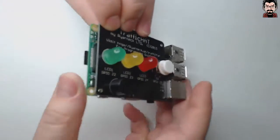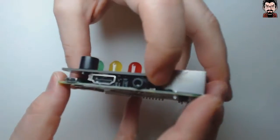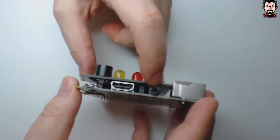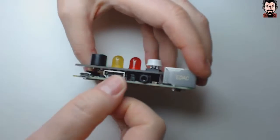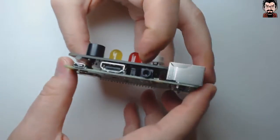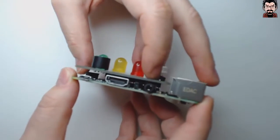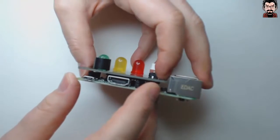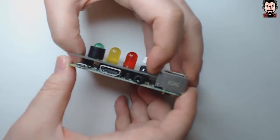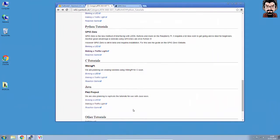And just to be fair, once you fix it onto the PCB, it really stays quite nicely on it, and there is really no risk in any of the components underneath the TrafficHat touching onto any of the parts of the Raspberry Pi, as the little EEPROM will stop the PCB from moving further as it just touches onto the 3.5 millimeter jack for the audio. So great, good design. Great, we are now ready to get some code running on the TrafficHat.